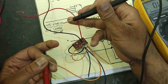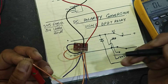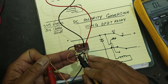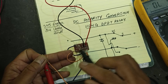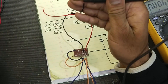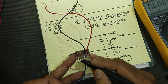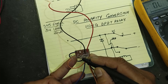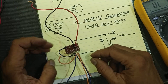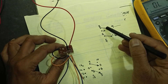If you connect positive voltage here, this positive voltage will reach the output terminal. The positive voltage reaching the cathode will not allow current to pass to the winding because it is reverse biased. The negative voltage will reach the output terminal and after passing through the winding these voltages reach the other side, but this circuit is reverse biased in this condition.